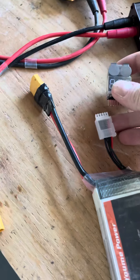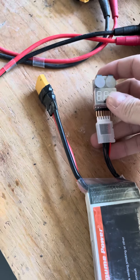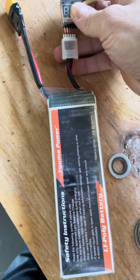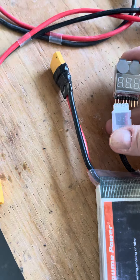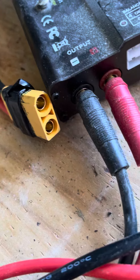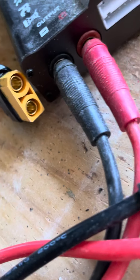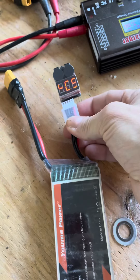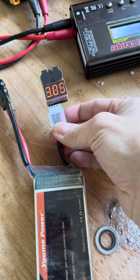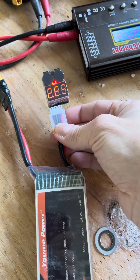All you do is plug it into the sensor port. You'll see this one is going to alarm because this battery is dead. This is a 4S, so it should have around 14 volts in it. You'll see it's alarming because it's only got 11 volts — it's hosed.